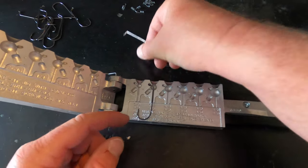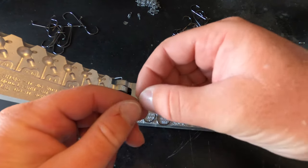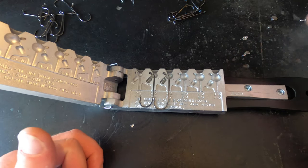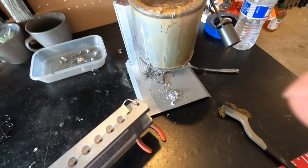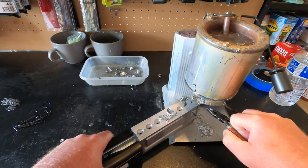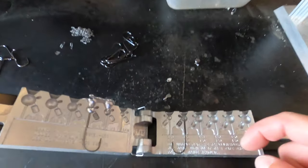Time for round three. We're putting the 3/0 hook in the eighth ounce and the 4/0 hook in the three-sixteenth ounce, and putting our screw locks in. I apologize for the construction or saw noise — I can't control that, sounds like the neighbors are getting some work done. These are ready to go. Closing up the mold, going over to the lead pot, adjusting the camera, pulling out the nail — three-sixteenth first, then eighth ounce.